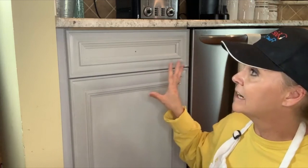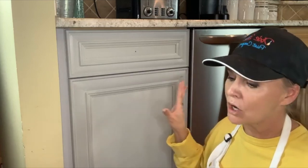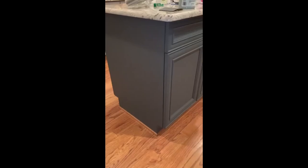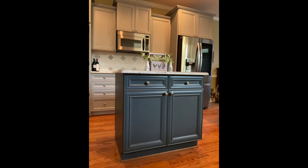In two to four hours I'll come back and put a second coat on, then wait until the next day before doing a clear coat. I plan on clear coating with Dixie Belle clear coat in satin for added durability — I have two dogs, kids, and vacuum cleaners hitting the cabinets. That's one reason I did Slick Stick first, for that extra protection. Here's the before picture — and this is what it looks like afterwards. The island is chalk mineral based paint and the rest of the cabinets are Silk paint with two coats of satin clear coat. Don't forget to like and subscribe.